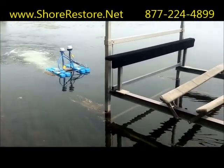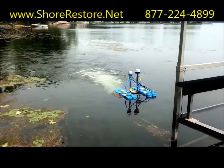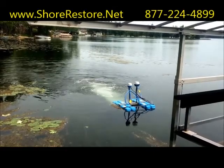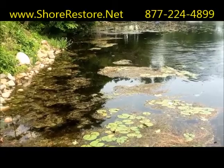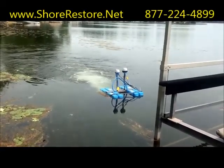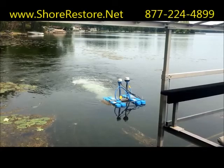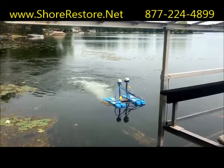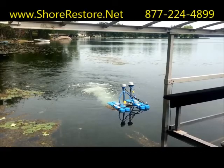Behind the machine, you can also see that the water is crystal clear. We are absolutely not stirring up the sediment and creating chocolate milk. We are aerating the water and creating circulation through the sediment that allows nature to process and get rid of those nutrients that were previously feeding all of this growth. By creating an oxygenated environment, we're creating the right conditions for beneficial bottom-dwelling aerobic bacteria to start consuming those nutrients as their food — nutrients that were previously just being used by the Eurasian water milfoil.